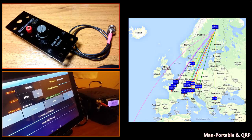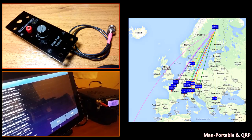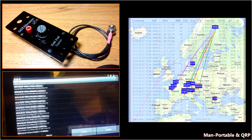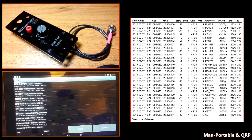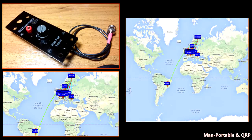Initially looking at the results, I just noticed the European stations. I saw Papa Uniform in there but it was just incomprehensible — like one of those brain games from the Discovery Channel. I kept looking at it and it just didn't click; it was actually incomprehensible. Then I checked the map again and I realized: wow, I hit Brazil — using 5 watts, in the evening after dark, on 10 meters, with a tuner I've never used. So okay, SOTA Beams, you got my attention.